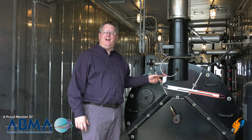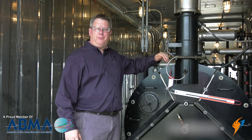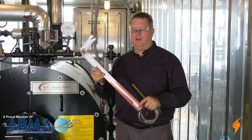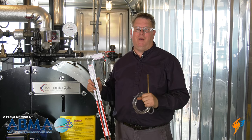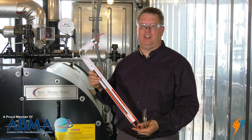A couple of useful tips for manometers. Number one: don't stick it on something hot enough to melt it. Number two: if you put this on something that's at a higher pressure than the manometer is scaled for, it's easy to blow the fluid right out of your manometer — nobody likes that. But whether it's filled with hydraulic fluid or water, convertible design or even an electronic one, a manometer is a critical tool when you have to make a precise measurement. Something everybody should have in their toolbox.